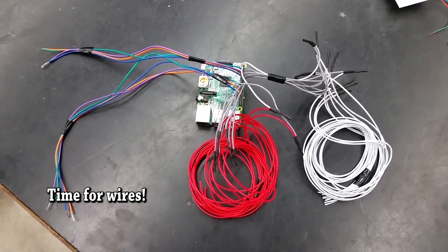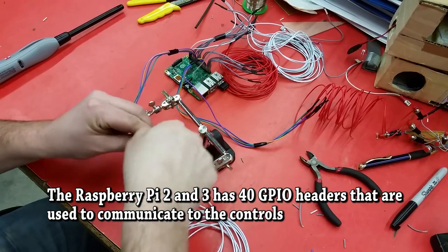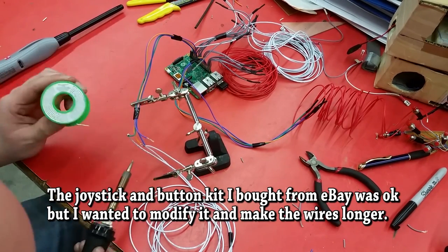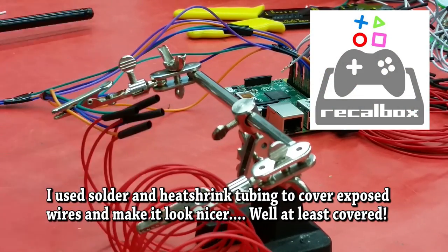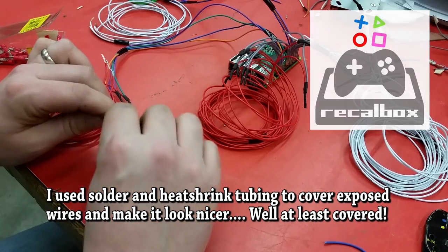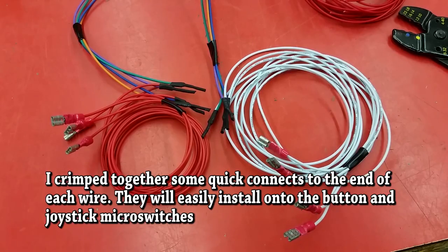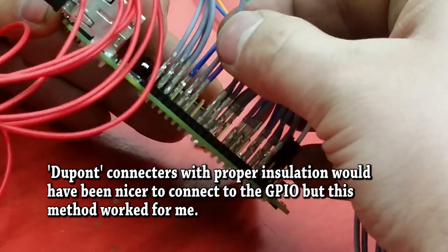Now for the wires — for this one I was using a Raspberry Pi 2. There are 40 headers that come off the Raspberry Pi — the GPIO — and I'll put a link in the description for where you actually install those. For my operating system I'm going to be using RecalBox. There's a website where you can download an image; it's extremely easy to use. Other people have used Retro Pi and Emulation Station which required a lot of programming, but this one is very simple and I can get it up and running in 30 minutes. For all my wires I use quick connects — they easily attach to the micro switches and I try to color code things when I can.